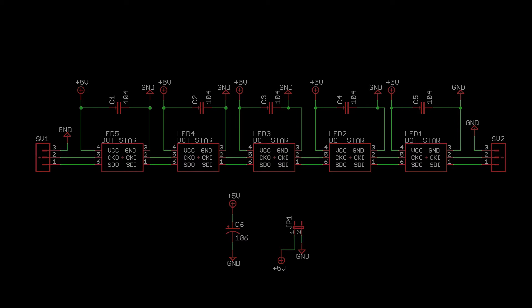Now let's look at how it works, starting with the light modules. Data and clock come in here, chain through the DotStars, and exit here. This setup allows modules to be cascaded together in series for lighting effects that propagate through several modules. Modules are powered by 5V, which will be supplied through a 16-pin Eurorack power connector. The layout for etching looks like this, the power connector being of surface mount type and hot glued to the back of the module.